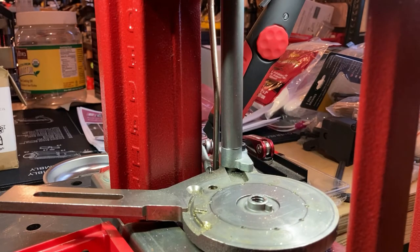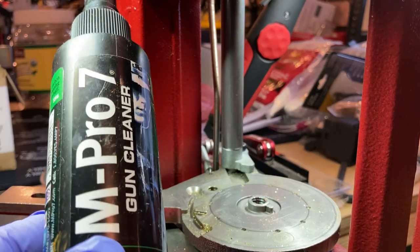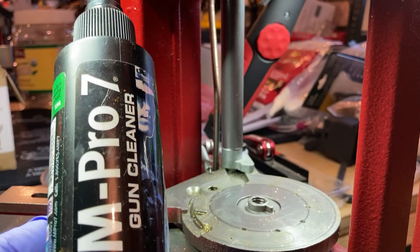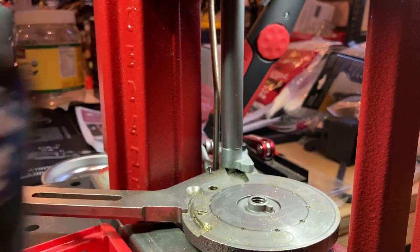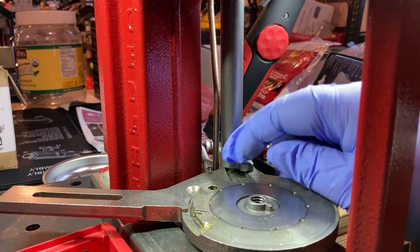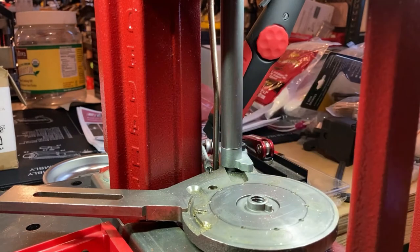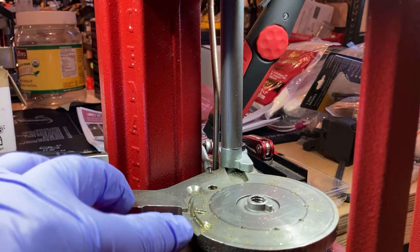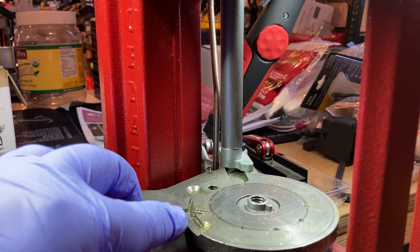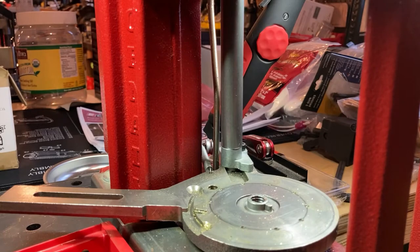What I use to clean is my preferred cleaner — I like M-Pro 7. It seems to be a mild cleaner that gets things done without being overly harsh. Looking down into the press body, there's a lot of debris in there. Not too bad around through here, but right up along where the cases get fed in and in these little grooves, there's definitely some stuff. So we're going to get a brush, clean all that out, get some M-Pro 7 and some cleaning patches and give it a nice little cleanup.